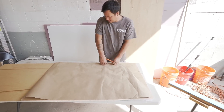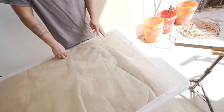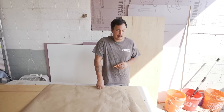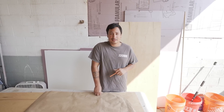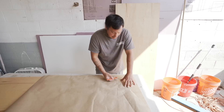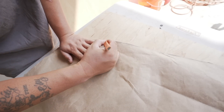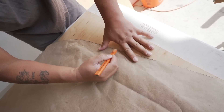Here's our tracing — I'm lining it up with the back. It's not going to be perfect, just in the ballpark. We'll have to bring this in multiple times and trim it out. You guys will tell me in the comments there are all kinds of tools for this, but I've used all of them and they all don't work. This hand-tracing method is the best way I've found. Get yourself in the ballpark and notch it out till it's right — that's how the Filipinos do it.